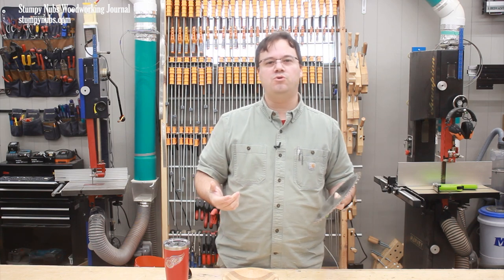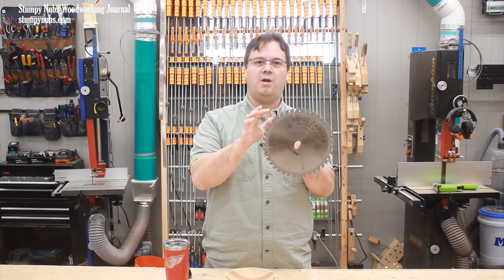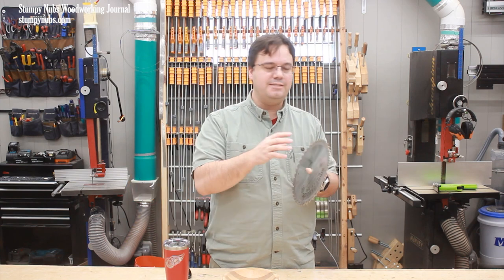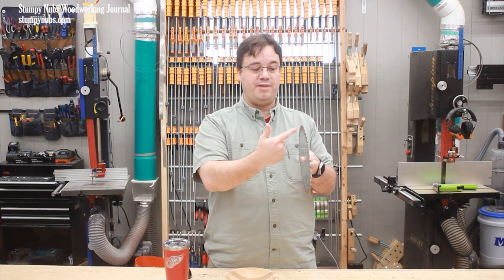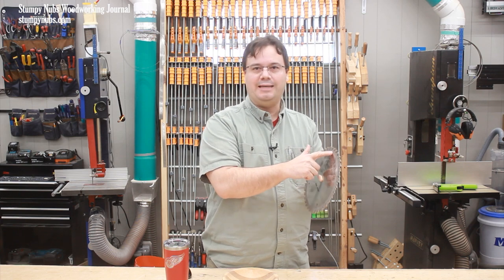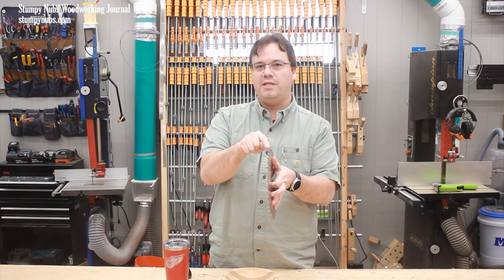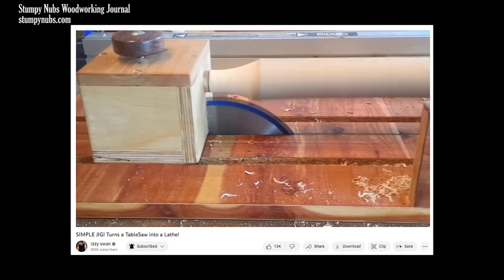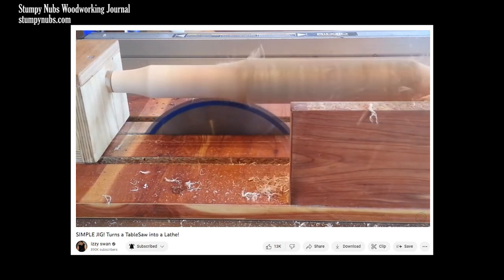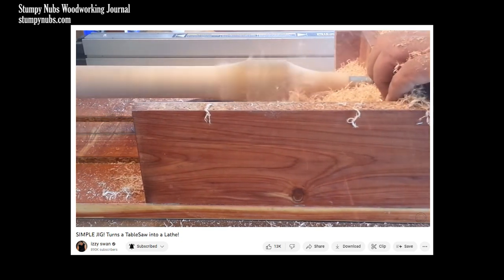Think about what a saw blade goes through under normal cutting conditions. Each of these teeth hits the wood at about 140 miles per hour — that's a massively hard collision — and it happens over and over, about 4,000 times every second. When a tooth strikes the wood with its face under normal operations, the steel of the blade is backing it up. But the cutting is not really done with the face of the tooth as much as with the tip, and those tips generally extend up above the steel blade plate. Those 4,000 collisions with the wood per second are direct impacts during conventional cutting, while it's only a side-swiping action that occurs with the teeth when you're feeding the wood in a sideways or angled direction.